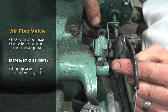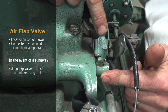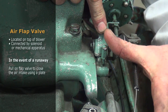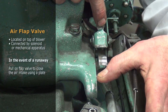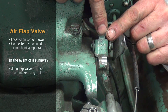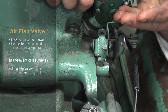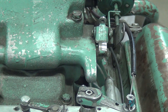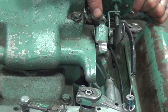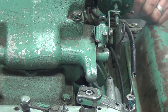Taking a look at the air flap valve on top of the blower — this can be connected with a solenoid or a mechanical apparatus that the driver uses to shut the engine down in an emergency or a normal shutdown. To reset it, I'm going to open the valve — you can hear it opening and closing. It's open, and I lock it. Now if I need to in the event of a runaway or normal shutdown, I can just pull on this and it closes off the intake with a plate. I'm going to set the flap valve to the open position, start the engine, and see how it responds when cutting off the air during operation. It's not as instantaneous as I'd like, but it still shuts the engine down.